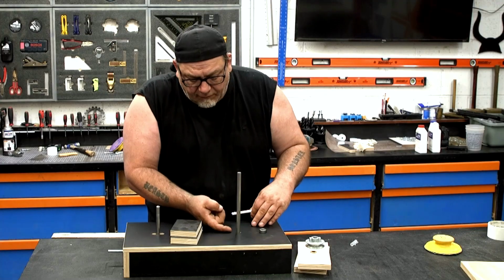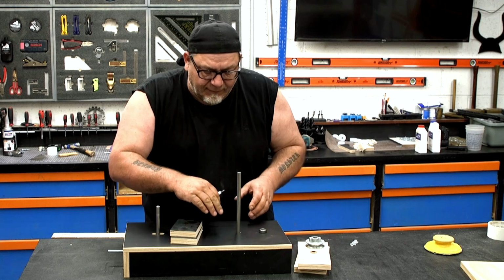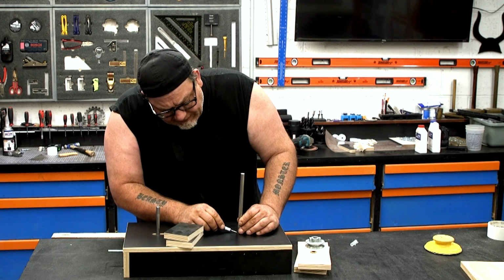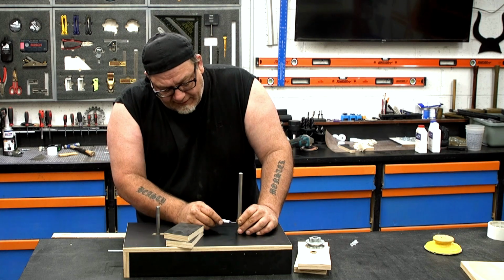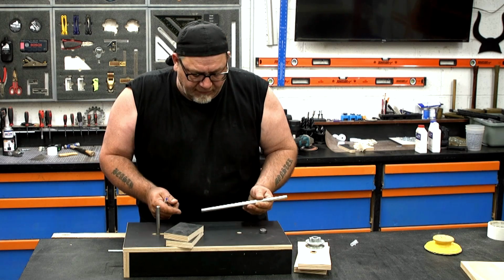I also need a 1/4 inch rod running through this for the discs to sit over the top of, and that's what's gonna make sure that when this is turning, the discs are turning. So that's gonna be about 1/8 inch high. So if I put it exactly flush with this, that'll lift it up 1/2, so 1/16 of an inch, and that will give me everything I need on all my measurements to make sure this rod's lined up.